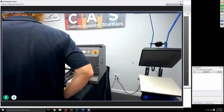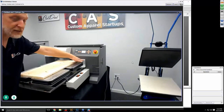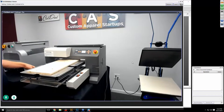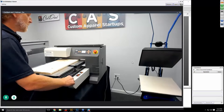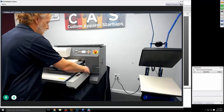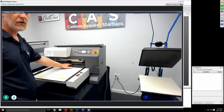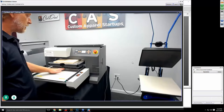All right. So now I'll go ahead and just slide my platen in manually, so that this part of the board is just inside the cover here, so that it sees the gap lasers. Raise it up until it hits the gap. And then I'll manually pull it through and let it adjust accordingly. I can always scan objects just by pushing them in slowly like this, to see if something's higher or lower. So I'm going to go ahead and hit load.